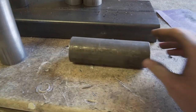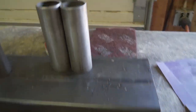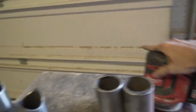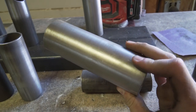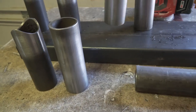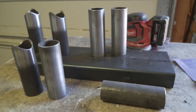On some flat tubing like this - something that doesn't have a notch in it where the tube is actually going to be landing - I'll go ahead and take the orbital sander with some sandpaper on it, spin it around, and you can see it gets it clean real nicely. Then I'll just go over that real quick with some Scotchbrite, which gives it a nice clean finish and it just overall looks better.